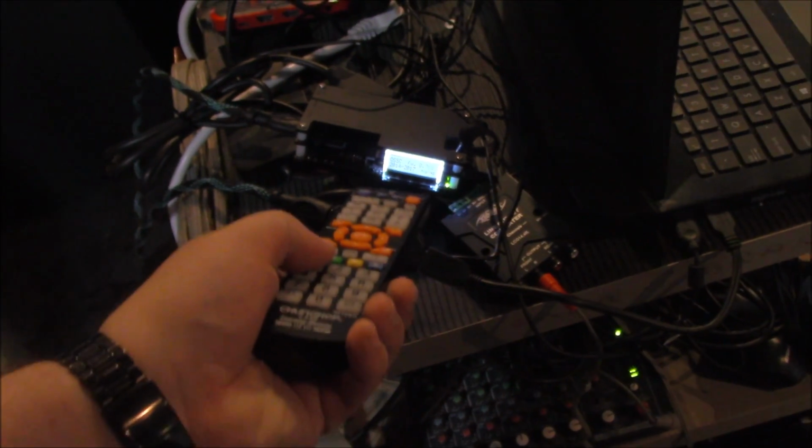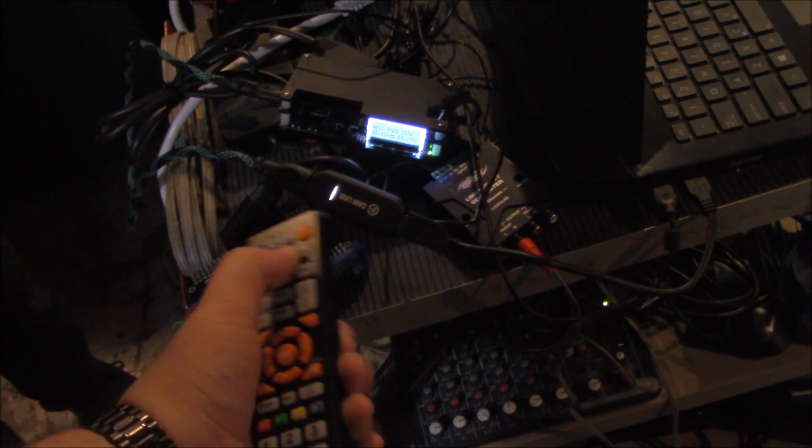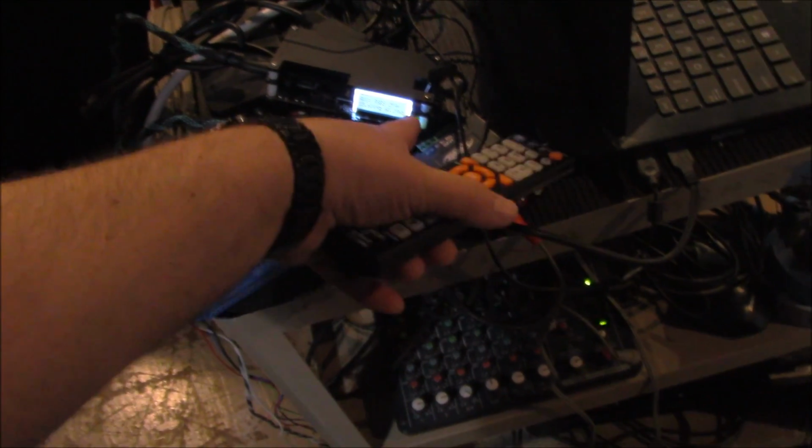Alright, so my OSSC I've got turned on. I want to set it to the first input, which is RGBS or SCART. So we'll hit input 1. And then we're going to use line triple mode, which is the highest compatibility that we've found. Green light means you're good, you've synced up. So now this has got a signal and it's outputting it to the Cam Link.